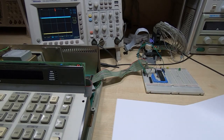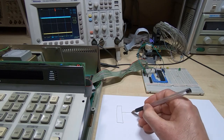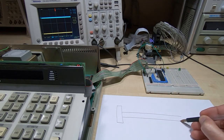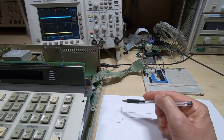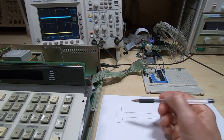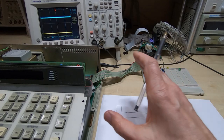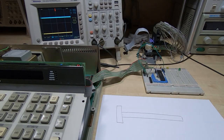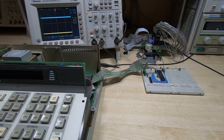Unfortunately, the Fluke isn't like that. It's got the microprocessor, and then its central bus is distributed to everything else, even this cable. So this cable actually connects directly to the data bus on the CPU, which makes it a very poor design, and it generates real flaky behavior, and I wanted to demonstrate that in this video. So if you are fault finding on something like this, and also if you want to design an add-on, then there are some pitfalls that you really need to be aware of. And as I say, that was the idea of adding this video to the series.